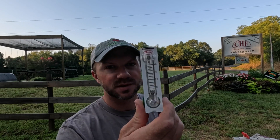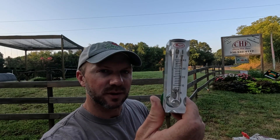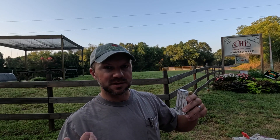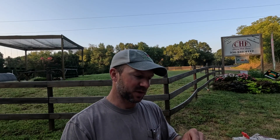You inject it with water so that you saturate the bed. With this little flow meter I'll be able to know exactly how many gallons per hour. The rate on vapam is about 37 gallons an acre for plastic mulch where you've got half the field covered. I can dial this up to 18 and a half gallons an hour, and I know it's going to take two hours because I'm sucking straight out of the tote — vapam metham sodium in a 275-gallon tote. You walk up with your mask and gloves on, drop the hose in, and walk away.